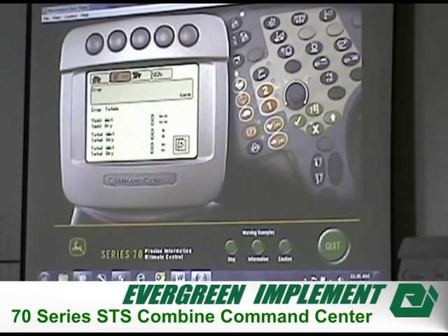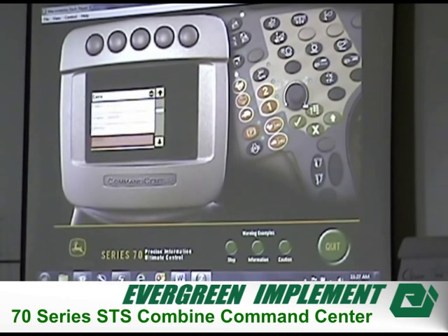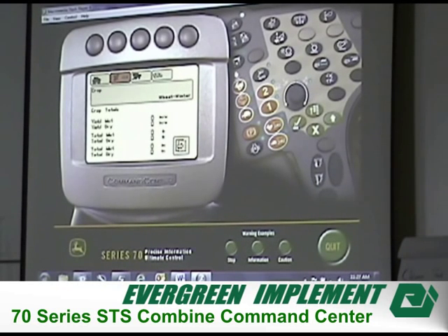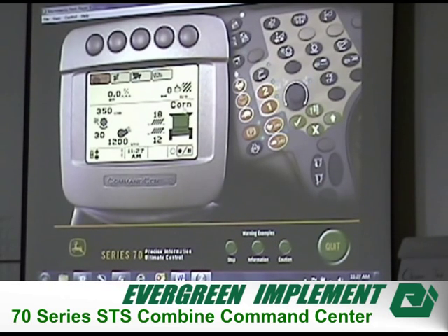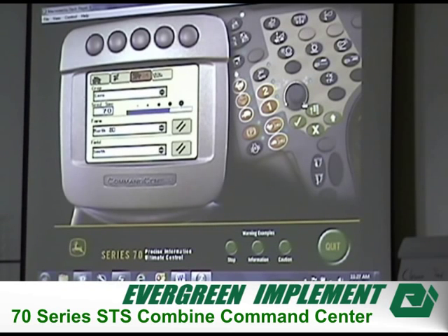Now we need to go to page four — it's still showing corn. So we scroll through and check mark. This is one spot where people get into it and aren't sure why it still says corn. The reason for changing it is we have an automatic combine adjust where we can have presets. You could program in your crop and all your adjustments, and then have it automatically go back to those settings — like three days ago you were on spring wheat and these were your settings.